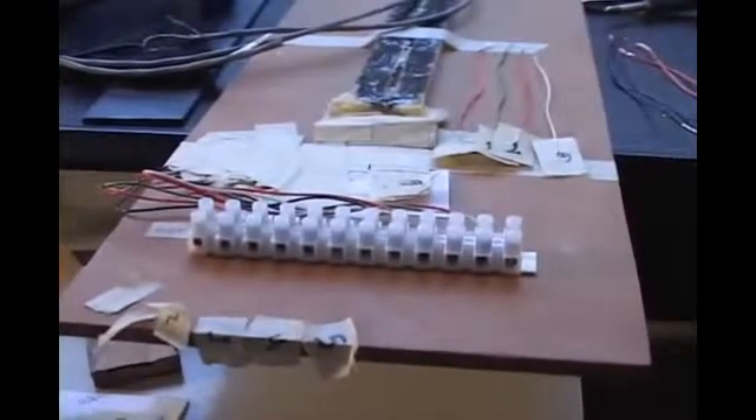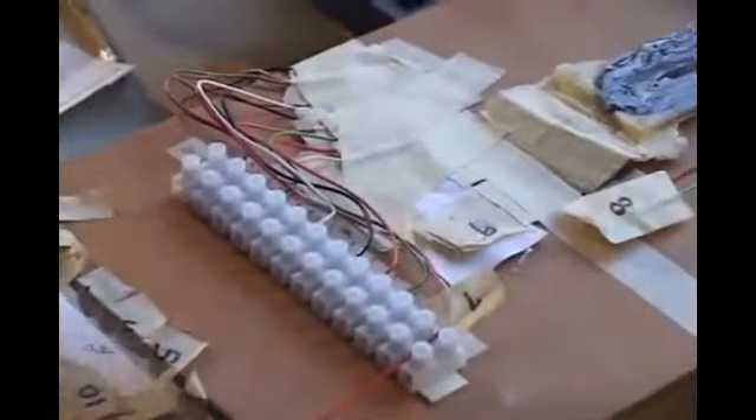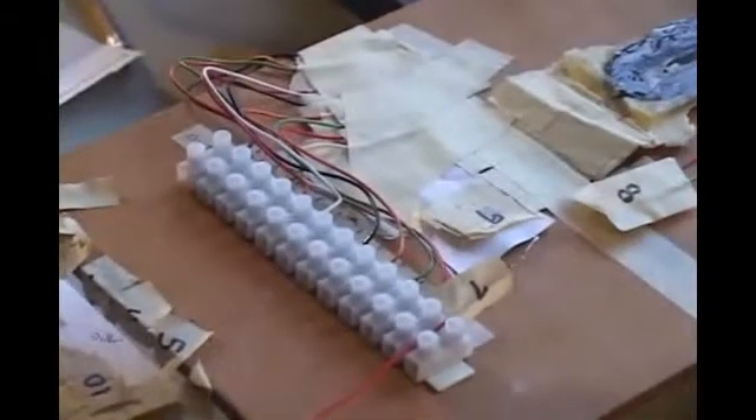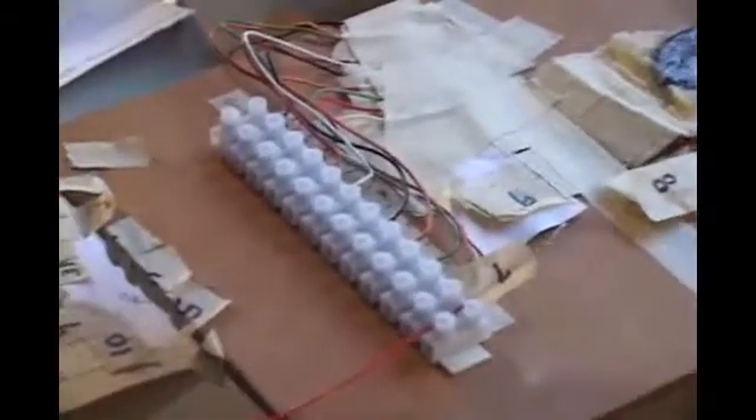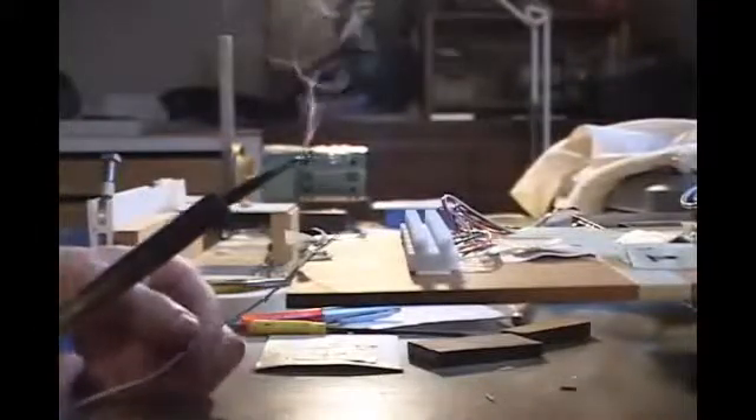I built the test coil on a piece of hardboard. For my jumper strip, I used a terminal block — cheap at all electronic surplus. It's simply a set of individual screw clamping pass-through wire connectors. Finally, I had to cut each loop and solder on short lengths of wire using different colors, labeling each as in and out, then insert them into the terminal block.